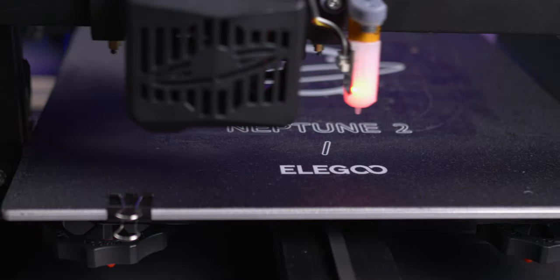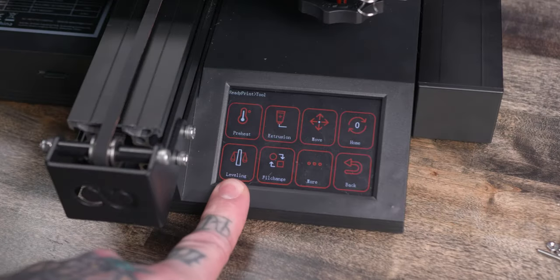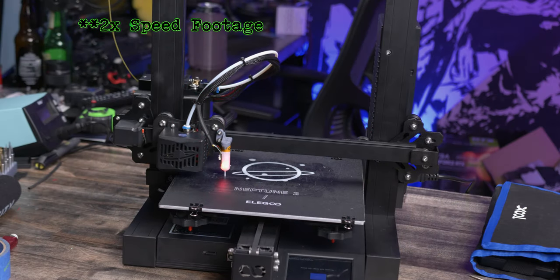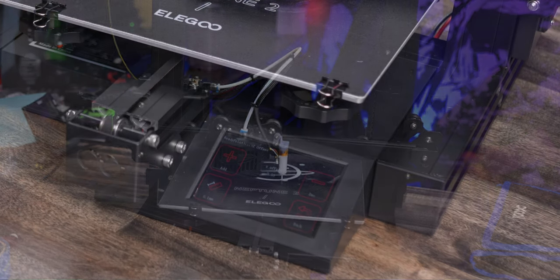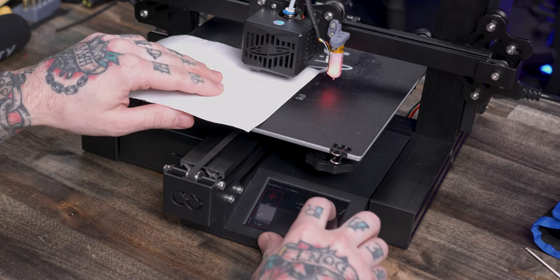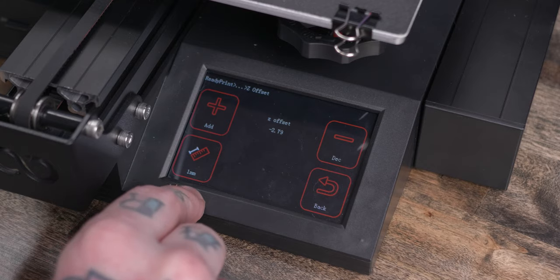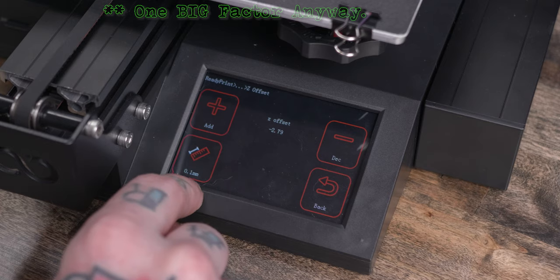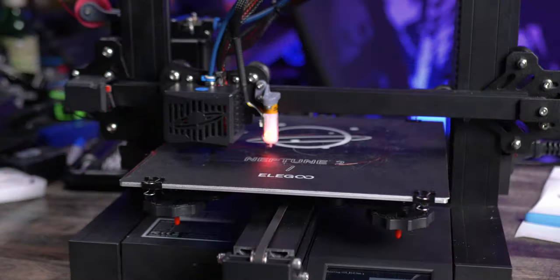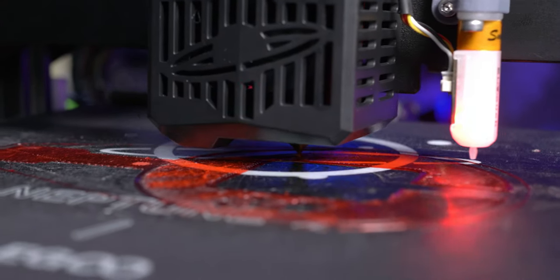Now it's time to do the Z-probe offset adjustment, and it's really pretty straightforward. I do commend Elegoo for the implementation they have on this — to a point, and we'll talk about that later. Go into your tool menu and you'll now have an auto leveling option instead of the previous leveling option. I recommend you hit that and let the machine do an auto leveling run — it will probe a 4x4 grid across the bed surface. When the auto level is complete, it will go directly into the Z-probe offset adjustment. Take a piece of A4 printer paper, stick it underneath the nozzle, and slowly lower the nozzle through the menu options until you get just a slight bit of drag on it. You can adjust from 1mm down to 0.1mm and then 0.01mm increments, and I recommend going that fine with your adjustments because this determines how well your auto leveling actually works. That is the complete setup of the BL Touch on the Elegoo Neptune 2 — from installation to firmware to Z-probe offset and printing. You can see I'm laying down a pretty good first layer in Greengate 3D Mars Red PETG, and it is laying down beautifully on the bed.